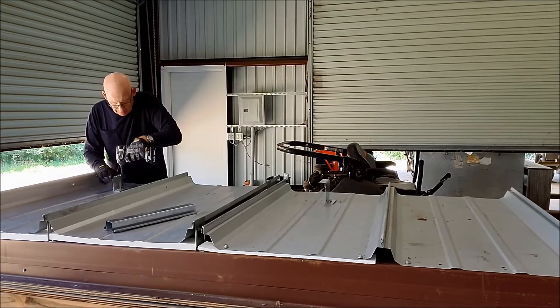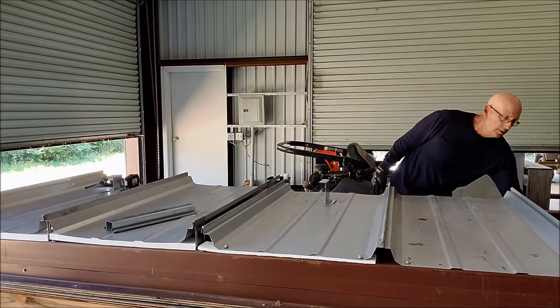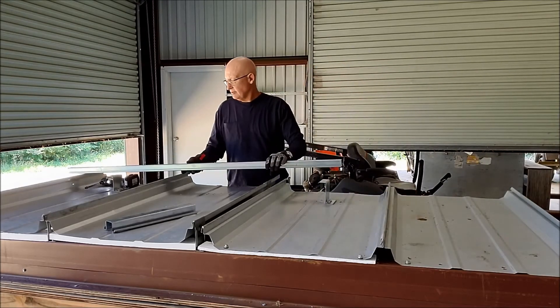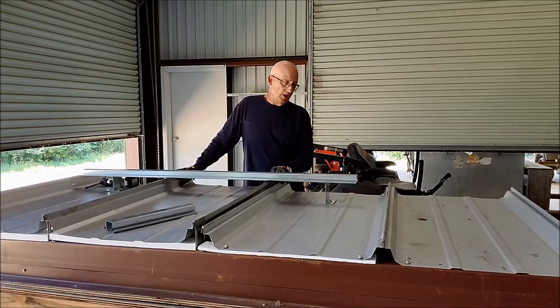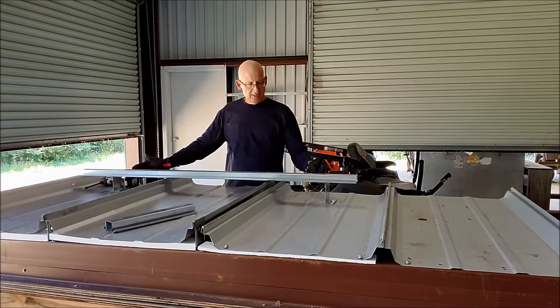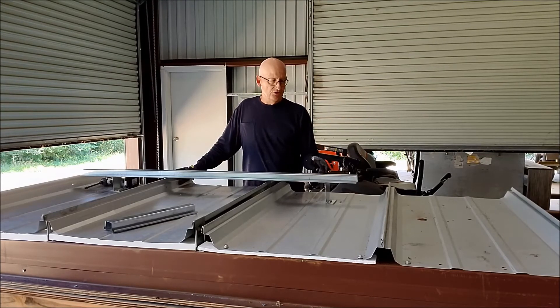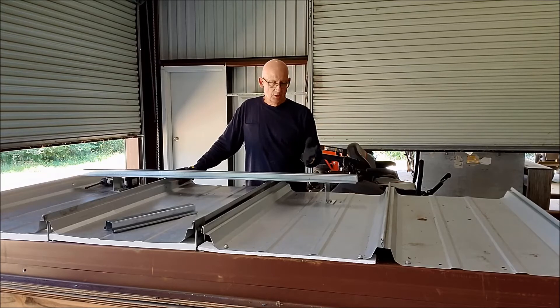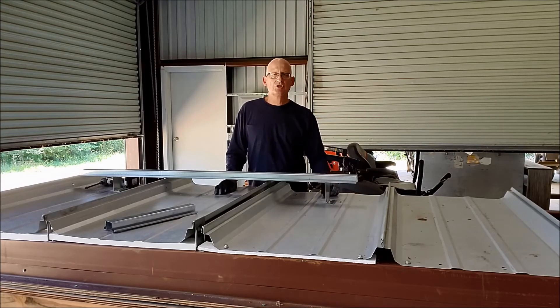There you go — your hats are set. Then you come back with a hat section and there you are. If you get these four feet on center, that means you're covering eight feet at a time with either two, four, six, eight, or ten fasteners — this is a very economical system. Once you get into the edge zone, you're either going to move these things to two feet on center, or switch over to a roof hugger or notch purlin if that makes it quicker, since the cost is probably about the same when you start spacing these things closer together.